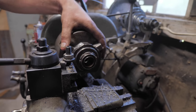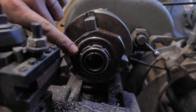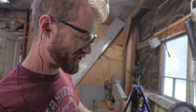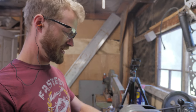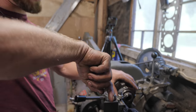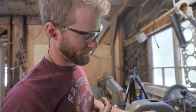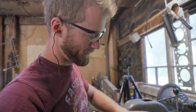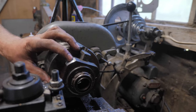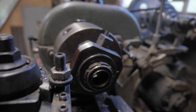So you guys saw the square we started with here. I test fit the bearing and it slipped right in there and got stuck, so it's going to just stay in there for the moment — it's the perfect size. But I don't want to take the piece out. I could tap it out from the back, but I'd have to take this out of the lathe and then it wouldn't go back in quite the same because it's a square. But now it's time to make this square round, and you can see I've just started — that's the highest point, so I've taken a little bit off there. I'm just going to keep chunking away at it.